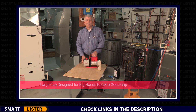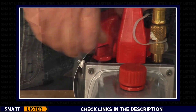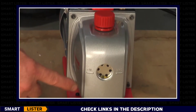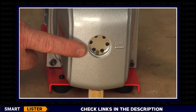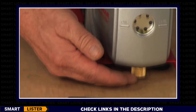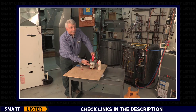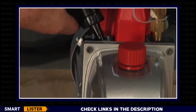Then take the plug out of the fill port and pour in the oil. The fill port is right here on the Robinair vacuum pump. We have here a quart of Robinair vacuum pump oil — snip off the end of it. When you fill the pump, you need to monitor the sight glass. There is an oil level line here; you don't want to exceed it, and you don't want to under-fill it either. If you go over, you can drain some out using the drain valve on the bottom. Make sure you're at least at the line — the pump will not be nearly as efficient if it's under-filled.